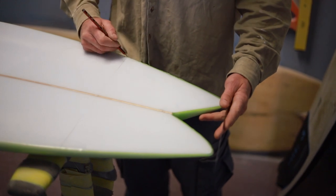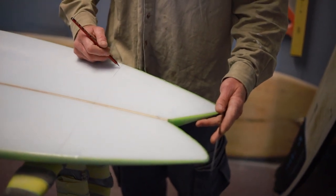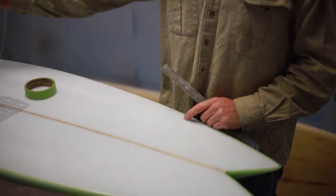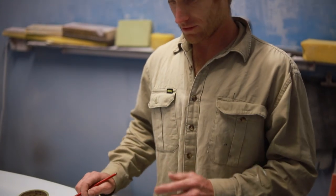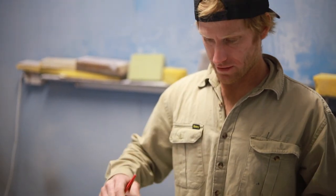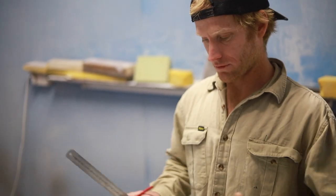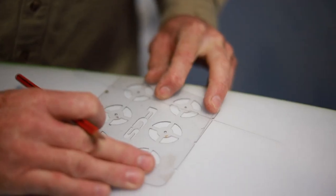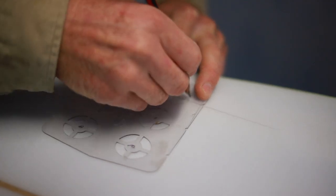So it's eleven and a quarter, and then from the rail we come in one and an eighth. Then we get a dot or mark and string line it. We're going two and a half inches off the nose, making it a bit straighter. We do that both sides and get an average out of the boat in case the shape's not symmetrical. That's how we cut the holes. Did you get all those numbers? There's going to be a test at the end of this video.